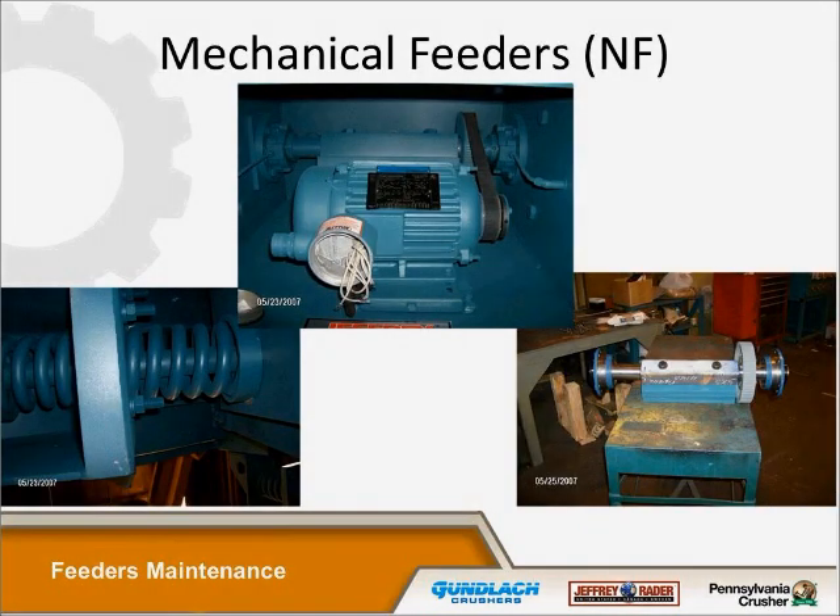This is a better picture of the electric motor, the eccentric shaft, and the timing belt on the mechanical NF feeder. Here you'll see the cup that holds the retainer of the spring that connects the exciter box to the deck of the feeder. If you ever have to change these springs, make sure you decompress the spring first — go under the pan and release the tension by taking the bolt loose a couple of threads, reducing spring tension on both sides. To get to the springs inside the exciter box, you have to take that motor out and the eccentric shaft out to get to those back bolts. These bolts are torqued to 500 foot-pounds on the coupling springs.